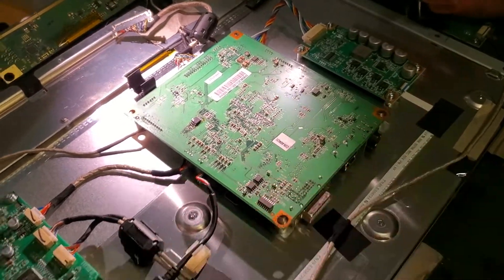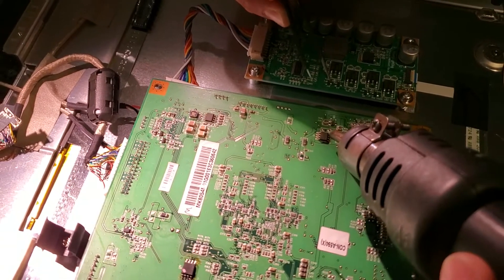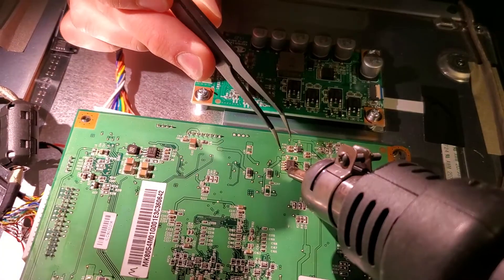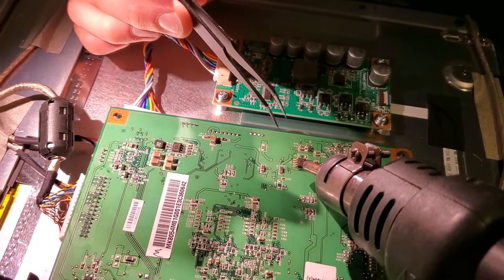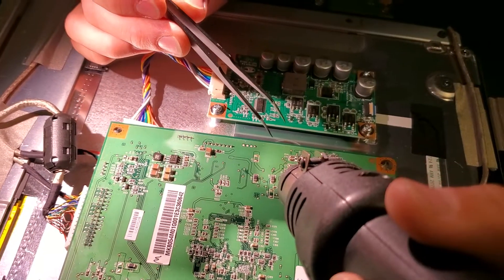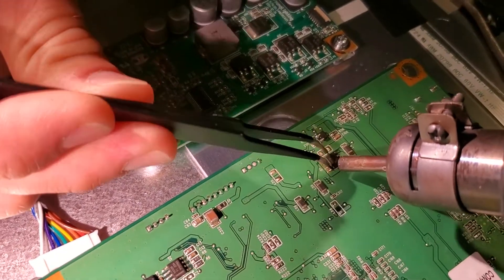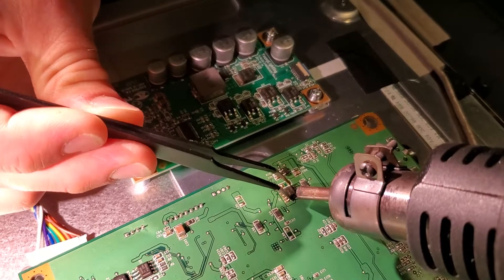What I do is take my hot air gun to remove it. I get it on there — it's pretty hot, I've got it at 428 and my air setting is around six and a half. I heat it up and jiggle it once in a while with my curved tweezers to see if it's loose. When it's ready it'll just come right off. Sometimes you have to work one pin side then the other. I tend to stick with this head because I go back and forth between doing these transistors and the capacitor work.